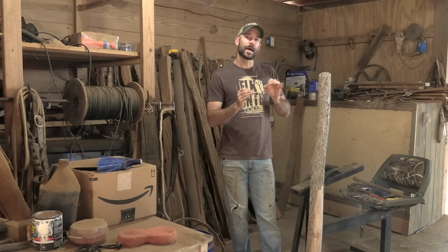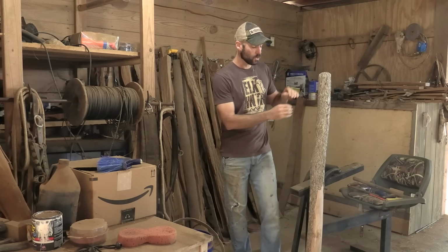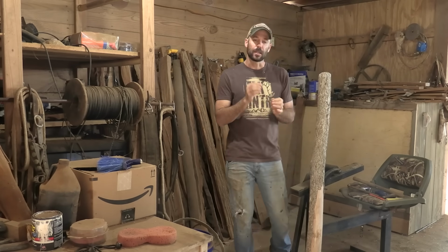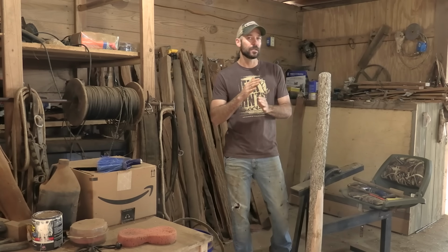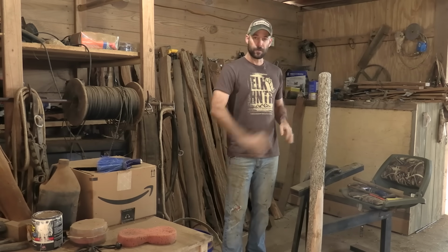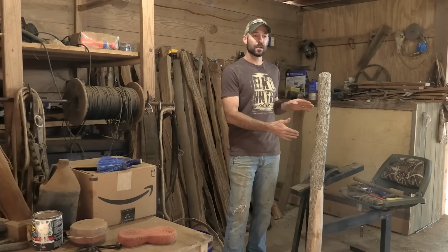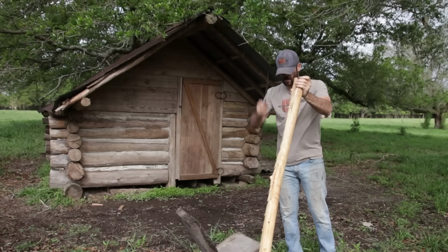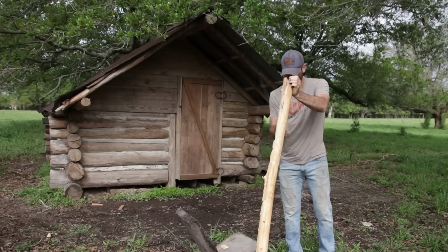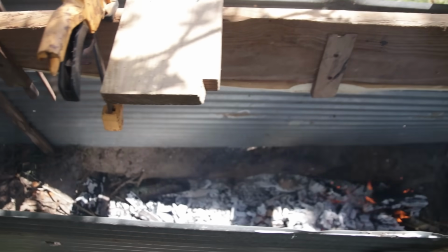Hickory will do that, but not nearly to the extent that other woods will. And so when hickory dries fast, it'll open up tiny little cracks, but they're kind of superficial. They don't really matter. And so what you can do is you can go out of the woods, cut a piece of wood, strip the bark off of it, rough a bow out of this stuff while it is sopping wet and green, and then you can actually force dry this stuff, and you could make a bow in less than 24 hours with hickory.